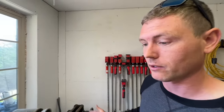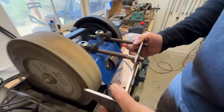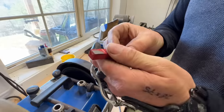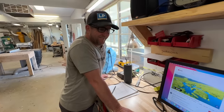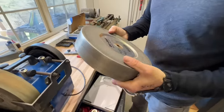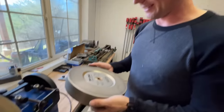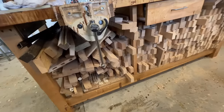It's really nice now that things have a place and I don't have it all crammed in together. I also made an attachment for the grinder to sharpen some carbide lathe metal-cutting inserts. To cut carbide you need a special wheel, so I got a diamond-coated grinding wheel — which was expensive, I won't lie. That's where all our profit went.